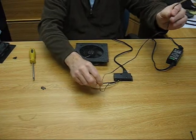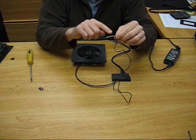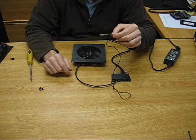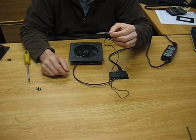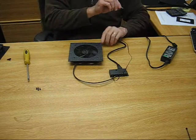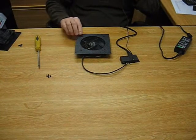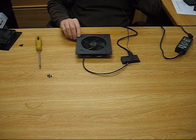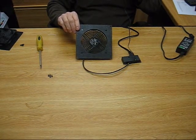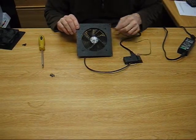You've got about a 2-foot length on it that allows you to place this probe in your cabinet where the heat accumulates. As you'll notice too, it's got a protective sleeve over this thermal probe. You want to leave that protective sleeve on. It protects the probe from damage like static electricity. Let's heat this up. Once it hits 87, 88 degrees, it goes on, and once it gets down to about 81, it'll go off. Simple as that.